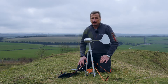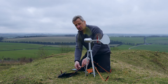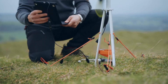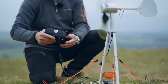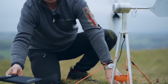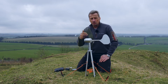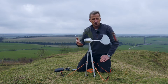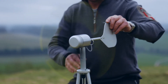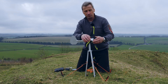So the next stage is working out a safe way of disassembling the unit. First, disconnect the power bank, then the solar panel, and put that away. The turbine blades can spin up to about 2,000 rpm so we want to slow that down. Simply take the tail fin, turn it through 180 degrees and you'll notice it's stopped down — put your finger on the top and that will stop the blade.